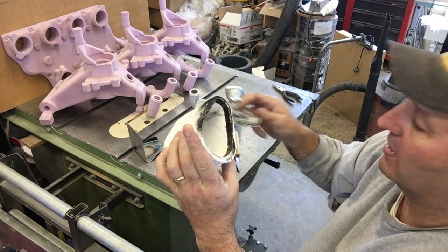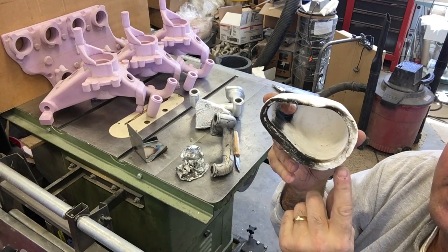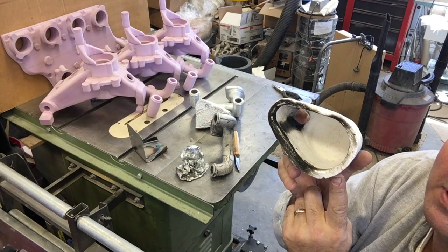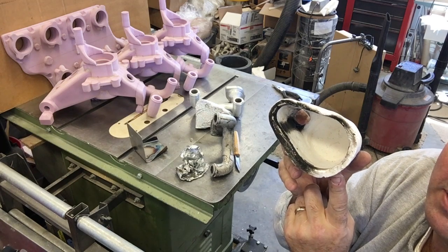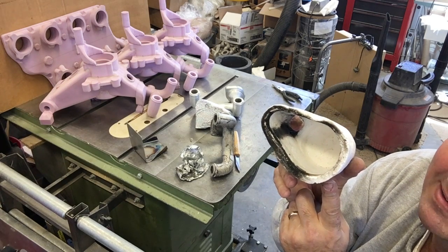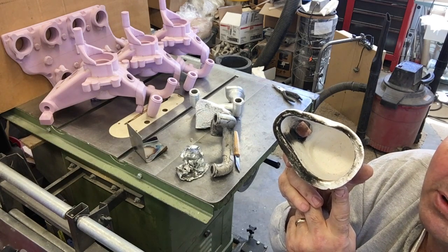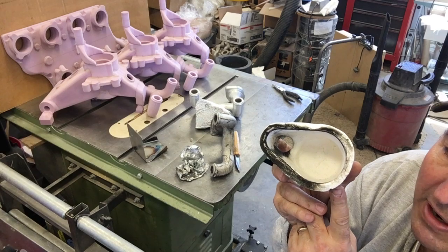I was able to pick the skin out of the pouring cup. On the pouring cup you can see a line going up the side — that's the flash path, probably the byproducts of the decomposing foam that flashed back into the crucible. Since it's on one side, I'm thinking I probably burnt through the membrane layer there, and since it was only about an inch to the top of the mold, it pulled in some air — maybe that was a contributor to the flashback. I'm thinking I want to repeat yesterday's gravity-fed run to confirm it produces the same result.